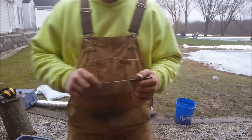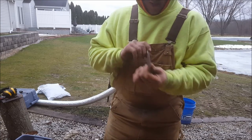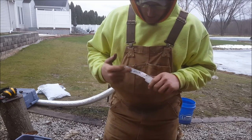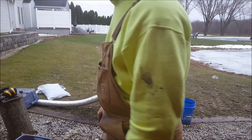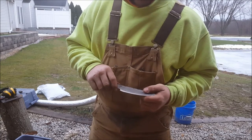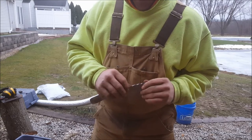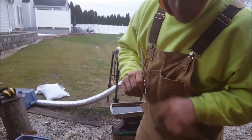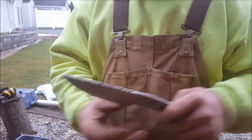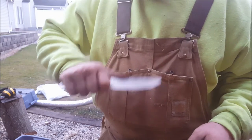There's our knife. I got the edge nice and clean, took it down to a beveled edge, and cleaned up the handle. On the blade, I'm going to go for a mirrored finish, so I tried to take all the hammer marks out of it. The cleaner it is when you quench it, the easier it is to clean up afterwards. On the top, I made a pattern here with a round file — I kind of like that pattern, and it'll give you something to hold to when you've got your hands on it.